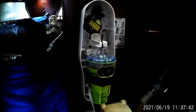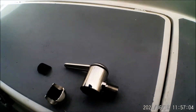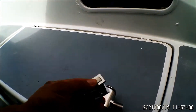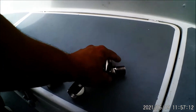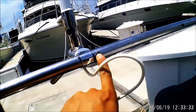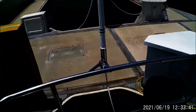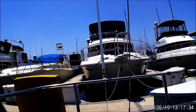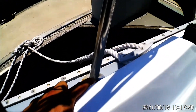Highly encouraged putting these on your boat. Here are some of the bits — this will go on to the stanchion here and allows it to be adjusted. I need to feed the wire through this hole through the stanchion and through the decking to keep everything dry. Worst thing about coaxial cable is moisture, so we're going to put it through this stanchion — it'll be easier to drill a hole from under the boat.